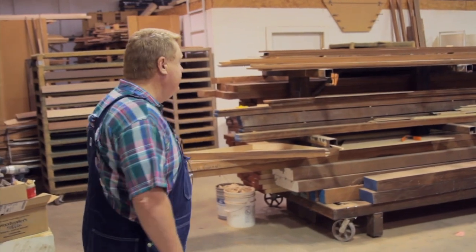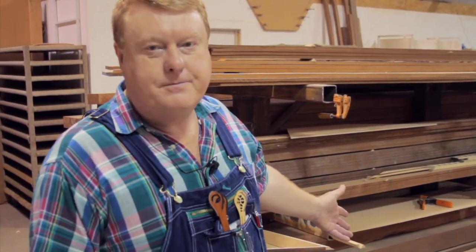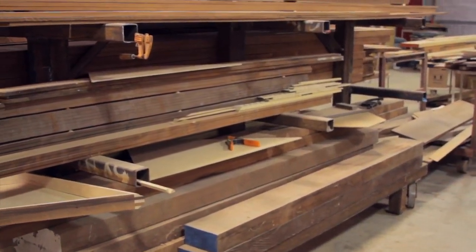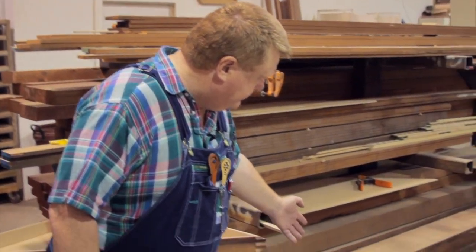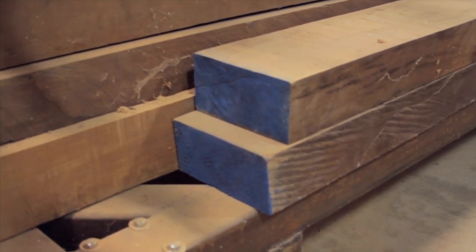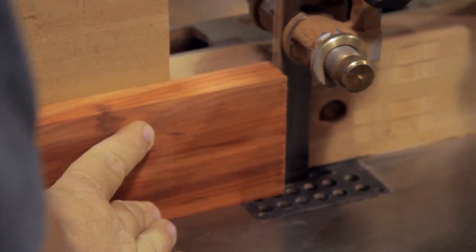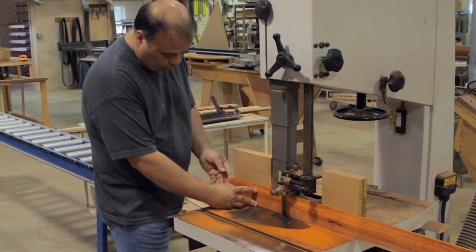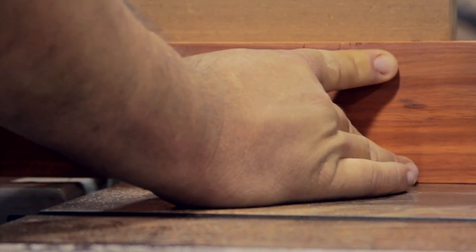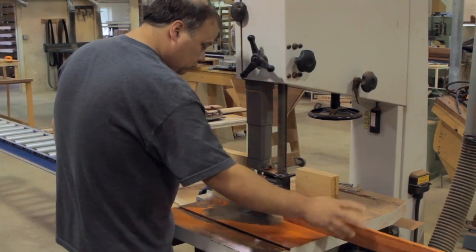This is how we actually begin. Sometimes folks ask where do you get your soundboards or where do you get your pin blocks — this is where they come from, raw pieces of wood. They come from different parts of the country and even other countries. These two beams down here that are four inches thick are genuine mahogany, and that is what the soundboards are made out of on our nicer instruments. We slice it up on a bandsaw — this is the first piece of equipment we actually start cutting with. The soundboard material could be sapele, could be spruce, could be cedar. It has to be ripped into thin pieces and then those are glued.